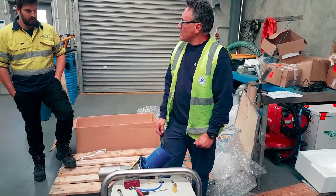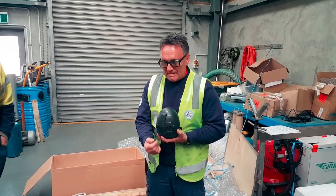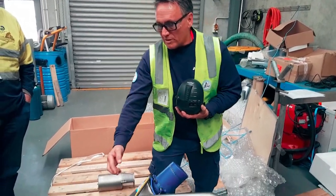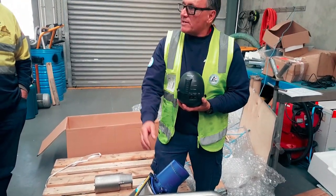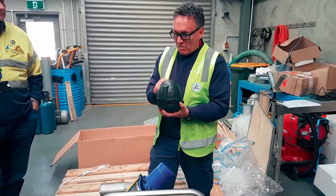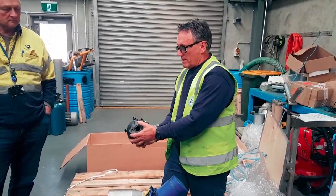We've got a Thinktop basic here? Yep. I'm going to show you what I mean. There you go, LED here, right? Yep. Another thing in the older types is if you have a look at this, wherever this is sitting, your air port into the actuator is always behind the LED. So if this was over here, the LED will be here. There we go.